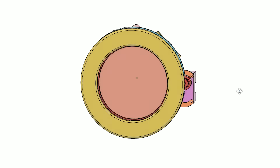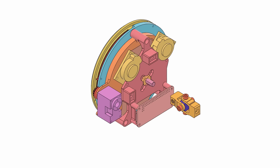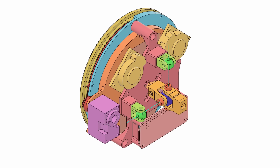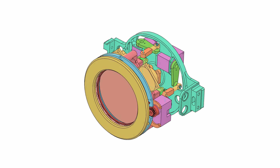Wheatley's inner eye needs to pan and tilt as well, so the eye assembly is supported by an aluminum universal joint. To drive this motion, there are two rotating blocks aligned with the axes of the U-joint. This way, the push rods that actuate the mechanism are decoupled, which means I can pan without affecting tilt at all.